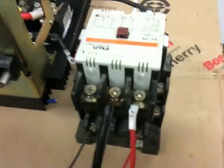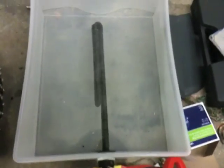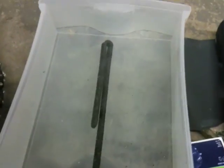There's our 100 amp contactor — follow that down and we find a 5500 watt water heater coil, 240 volt. That's 10.4 ohms, which will give us 26 amps to our torch right now with just one coil. I'm going to hook up three coils in the end.